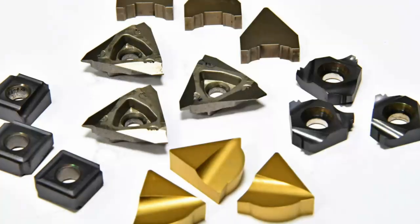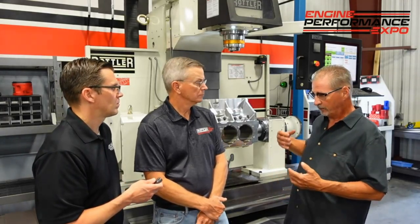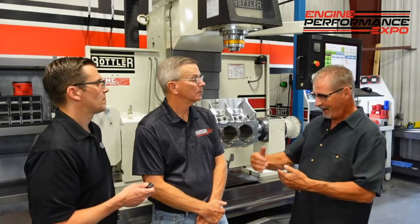That's the whole idea of having a coating on the tool — it's basically a dry film lubricant to prevent adhesion of what you're cutting sticking to the tool edge. Another thing the industry does is a post-coat process: they'll apply the coating and then actually go back and remove some of that coating so that on the first cut, that coating is not holding you up, because sometimes too much coating will adhere and make it worse. They found this out over time — the more they used it, the better the insert they got. So they remove some coating to get back to the proper cutting edge.